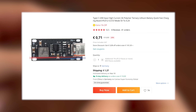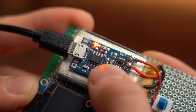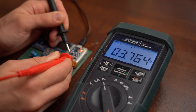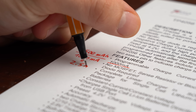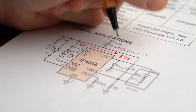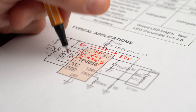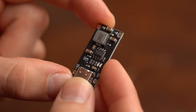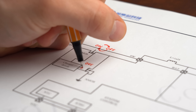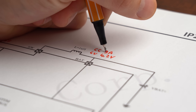Getting back to electronics with this 3A lithium battery charging board that you can get for only 70 cents. I got interested in it because so far I was pretty much always using a lithium battery charging board based around the TP4056 IC, which works without a problem. But the IC dissipates quite a bit of heat while charging up a battery and its charging current is limited to 1A, which sometimes takes forever with bigger batteries. The reason is that the TP4056 works in a linear fashion, simply getting rid of the excess voltage by dissipating it as heat, which is not efficient. This new board though is based around the IP2312 IC, which utilizes a switching regulator to efficiently convert the 5V input voltage to the required constant current, constant voltage for the battery.